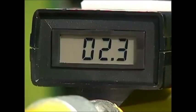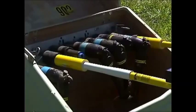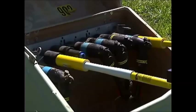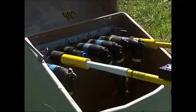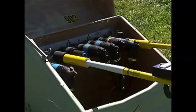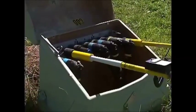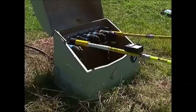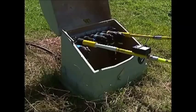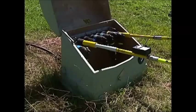The only other condition that happens extremely rarely is a burnt-open cable in very dry conditions or in sand. It accepts the DC charge but you have a cable that's burnt open and it's showing as good. What you might want to do is go to the next cabinet, put your URD grounds on that cable, then come over and high-pot it again. If you don't see the full line-to-ground current flow, it's in fact open. As for the highest reading acceptable as good cable — possibly 70 percent of that 70 percent, so around 2.4 to 2.5, but it must be stable. It doesn't fluctuate. It stays at the same reading, which would identify cable that's leaking.